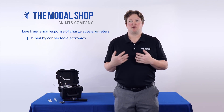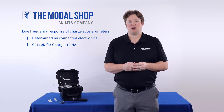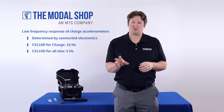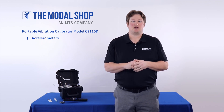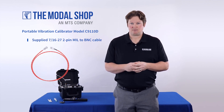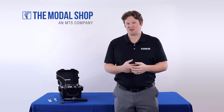That's the calibration certificate for the 357B04. You might be wondering about the low frequency response — for a charge mode accelerometer, that's determined by the electronics you connect it to. The low frequency limit of the C9110D when calibrating a charge mode accelerometer is 10 hertz; for all other sensor types — ICP, voltage, modulated current — the low frequency limit is 5 hertz. The C9110D also works for differential accelerometers found on turbine engines in aerospace or the energy market, and is supplied with a cable that mates to the most popular transducers in those markets. For more information, please visit the video vault on our website. Thanks for watching.